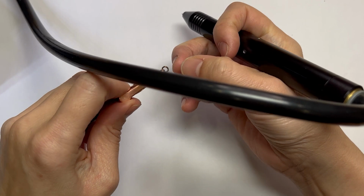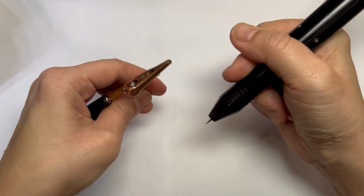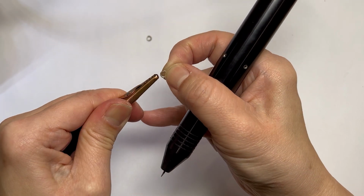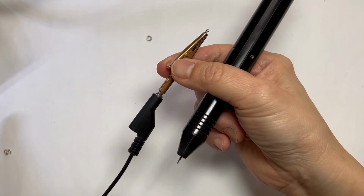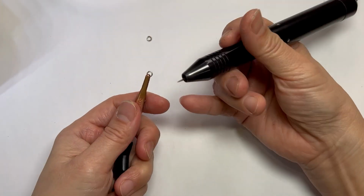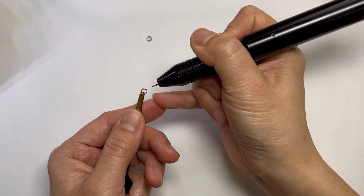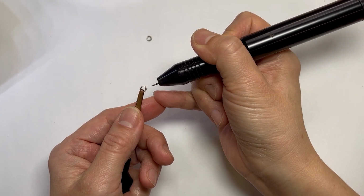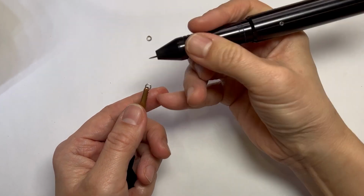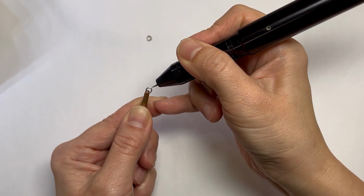Okay, so I'm going to try the experiment again. This time I've sharpened my electrode so that it's the same sharpness as though it was new. And I'm going to increase the power to 12.5 watts and see if there's a difference in making it stick, see if somehow it gets stuck to the electrode with the jump ring. And I think it has a lot more to do with pushing too hard. But let's see.